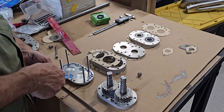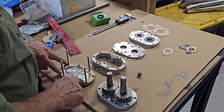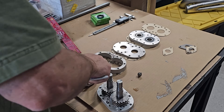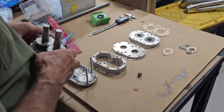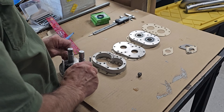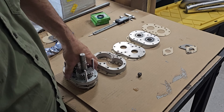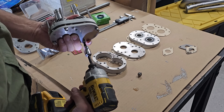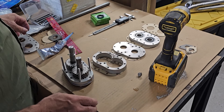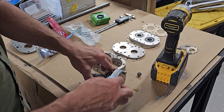Each layer is going to be siliconed and have a paper gasket. These gaskets don't really need to hold any kind of fluid — we're going to be using grease in the end, which wouldn't be penetrating beyond the gasket much. We could go just with straight silicone, but for ease of disassembly and a perfect seal in case there's any kind of water that tries to intrude, we're using both. The machine screw hardware fits so tightly that I can tighten up and bring things together, throw a couple of nuts on there, put the bind on it and see it squeeze that silicone out.